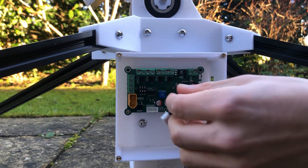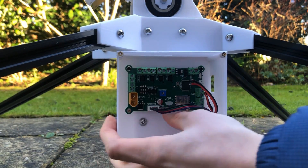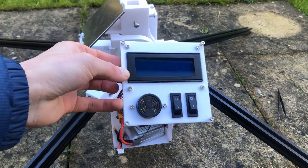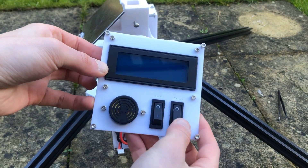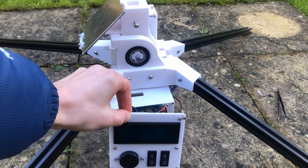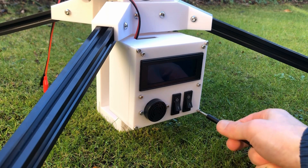The PCB is mounted in a box on the front of the launch pad and the stepper motor, limit switch, action button, and lipo are all connected. This front panel has a four line LCD to display some information about the pad's state, a buzzer, and two switches.